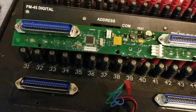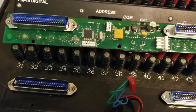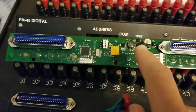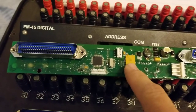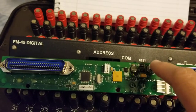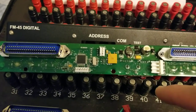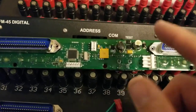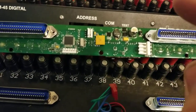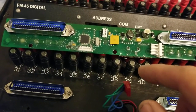With that being a programming header, I went ahead and found out what the MCU is. They've gone with a Microchip PIC 18F45 — a decent little PIC, not the easiest thing to get working. I found the datasheets off of Microchip's website but I don't have a programmer. You saw earlier a TL866 EEPROM programmer — it hasn't been able to do it. This board has three fuses: a large fuse I believe is for the main power, a little fuse for this section which is a buck converter that takes down the voltage of whatever you put in and spits out five volts — or three, can't confirm — but it converts the power down to run all the other electronics.